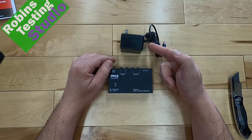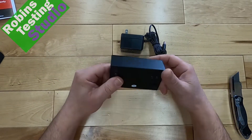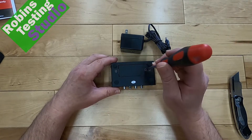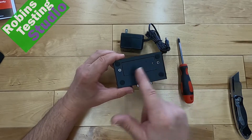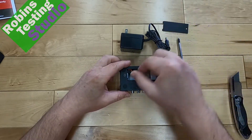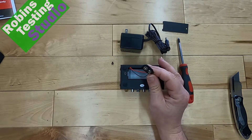Or if you're really stuck and you cannot accommodate this AC power adapter — you can either run it off this power supply and just leave it plugged in all the time, or you can simply install a 9-volt battery right in here. To do that, there are three screws, but I think we only need to take this one off here. Screw's been removed, left the other two screws on the outside. We do have to kind of finagle and get this little door to pop off — and then magically hiding inside is a plug for a 9-volt battery.